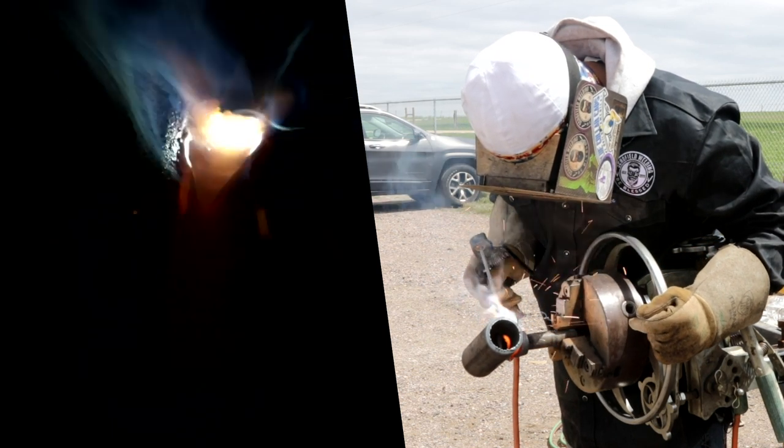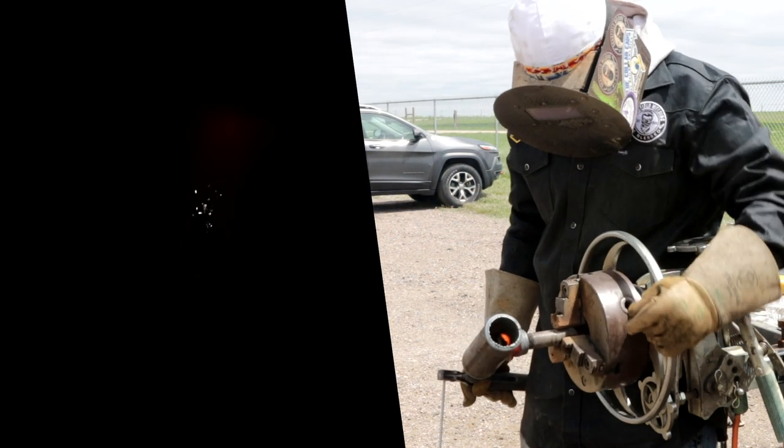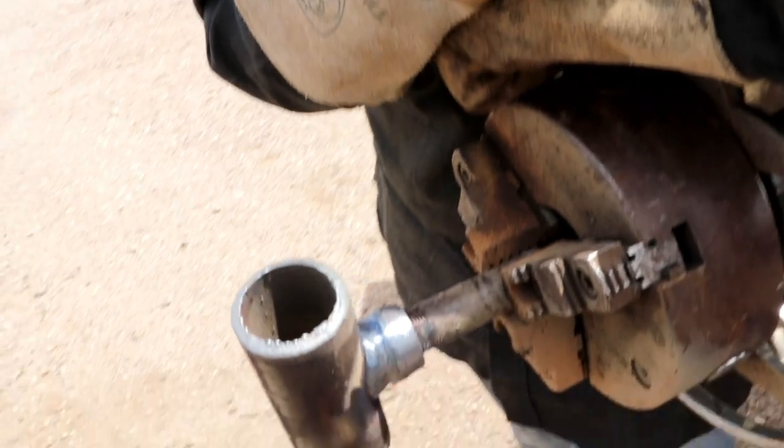If you can figure out how to do rollouts on your Threadolets, you're gonna gain a lot of ground through the day. You can roll out as big a Threadolet as they'll let you, or as long as you can find the nipple for it. Hopefully that was able to help you out and give you a couple tips. Make sure you subscribe to Schofield Welding, WeldTube, and South Coast Welding Academy, and hit the notification button so you're notified anytime we upload. Have a great rest of your night, be blessed, and we'll talk to you in a bit.